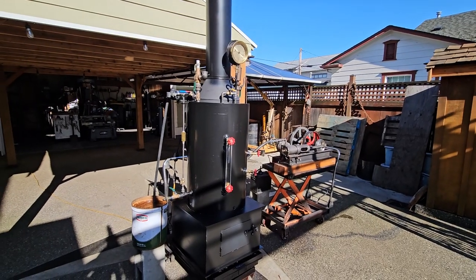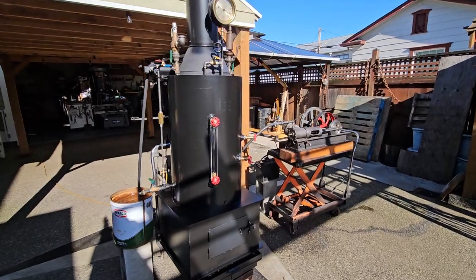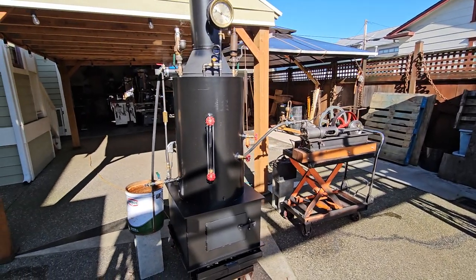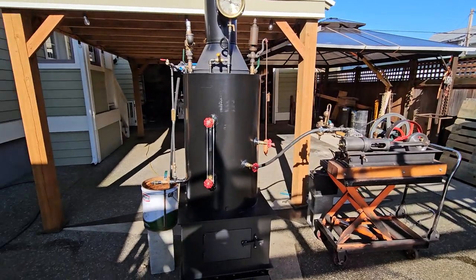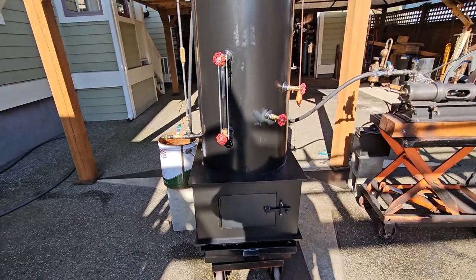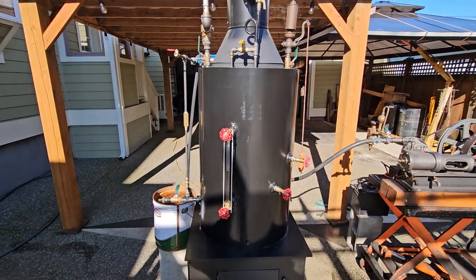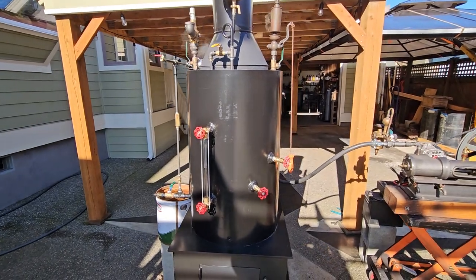Here's my latest combination. I have one boiler and one engine, and it generates electricity — DC. The boiler is one of my standard 20-inch boilers, 24-inch base, 32 inches tall with 22 inch-and-a-half copper tubes rolled in.